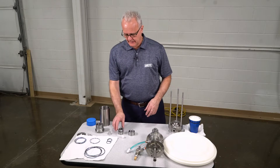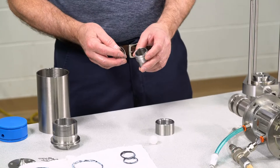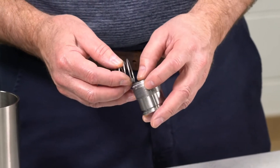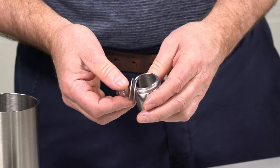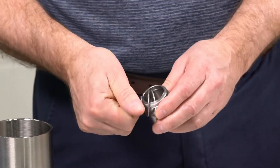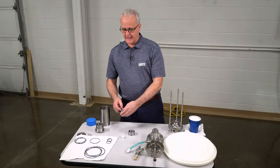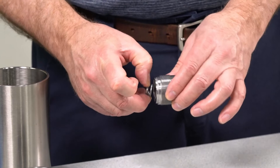The first part we're going to assemble is the lower ball and spring assembly. The proper way to put the spring in is — the spring is cut and where the two pieces meet right here at the bottom. I'm going to take that, slide it, take my fingernail, spread it a little bit, and slide it on like this. Then I'm going to turn the spring so it screws itself in and it'll snap into place. The reason we do it this way is the spring is captured in here so it does not have to always come out when it's being cleaned.